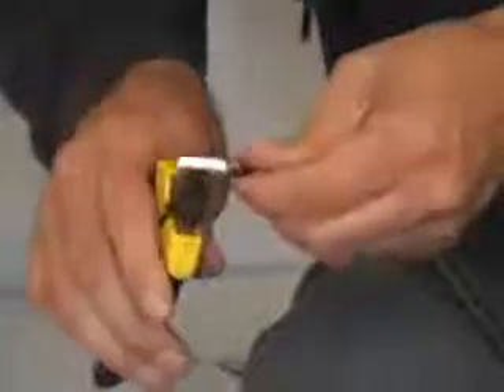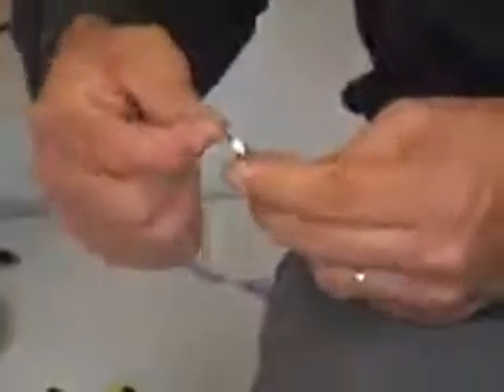By hand, I pull off the excess foil. Then with snips I make an incision in the white foam about 6 to 7 millimeters from the end of the cable. I twist and remove that excess section. The central core wire is now exposed, and I can confirm no earth wire is touching the central section.